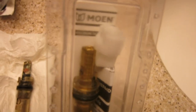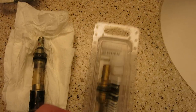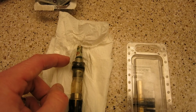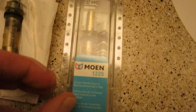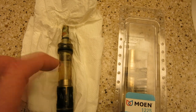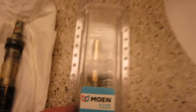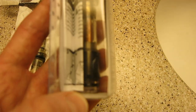This is the brand new one. Here's your little special tool — that little white plastic cap — that is what turns the top. But I showed you how to do it with your needle nose pliers. If you do go for a new one, it does come with a plastic cap, but just know that if it's been in there for many years it will be tough to turn if there's a lot of corrosion. This is MOEN part number 1225. If yours looks exactly like this — with an O-ring where my thumb is, an O-ring here, and it's brass on the inside with a plastic outside cartridge — they call this a Single Handle Faucet Replacement Cartridge. This was about $22 after tax. I'll link it in the description box. I matched it up as the same exact thing in the store, so let's put this new one in.